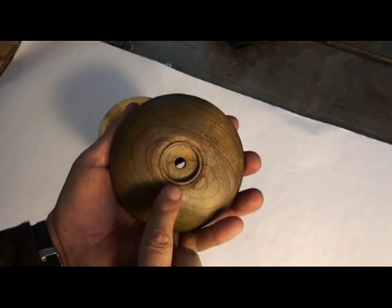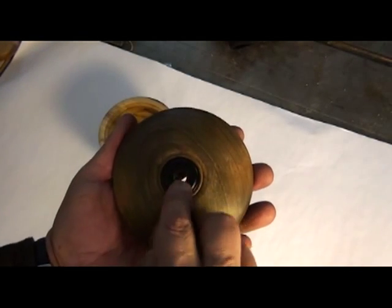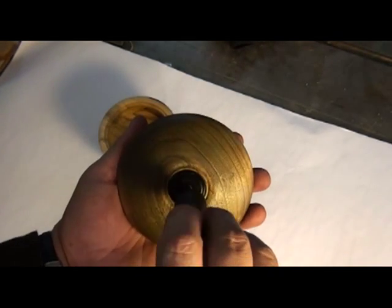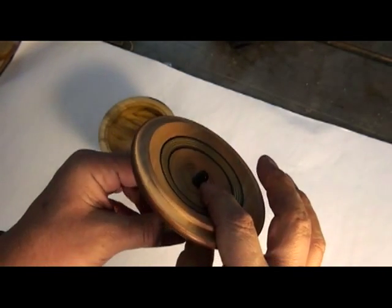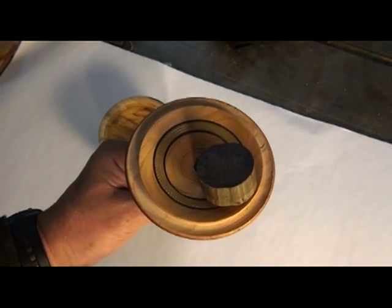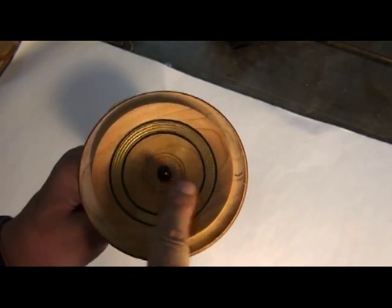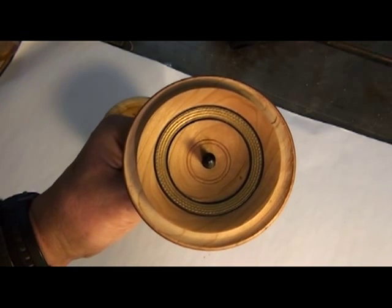You're looking at the top of my lid from my box — that's the inside. I've got a little decoration there. This will be the blackwood washer and here's the future finial detail; it's threaded. That will go through the top of my lid and I need to secure my threads with a nut that I'm going to make out of this piece of lignum vitae. That is the next step in our project — it's going to be threaded onto this with female threads.